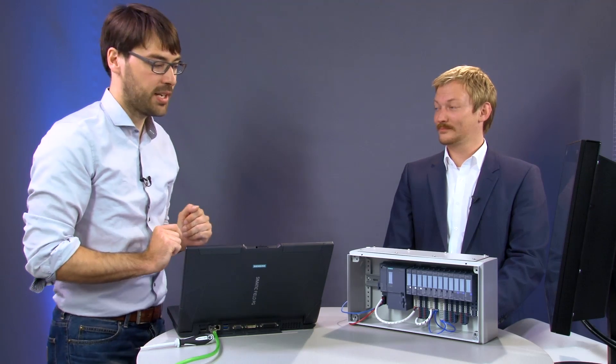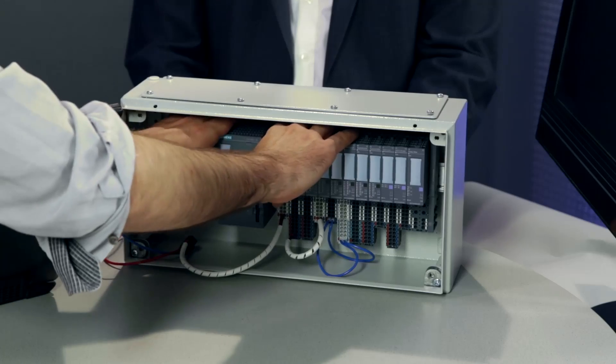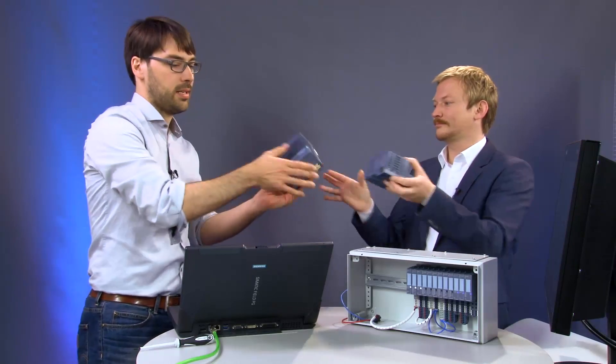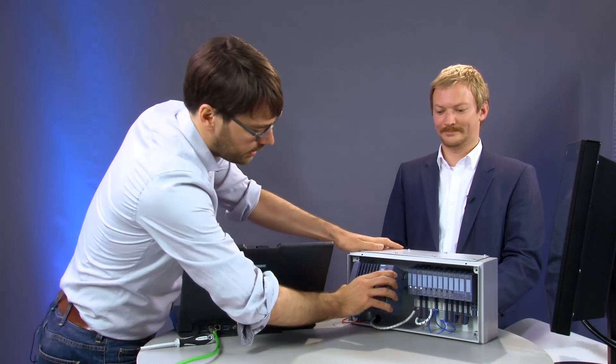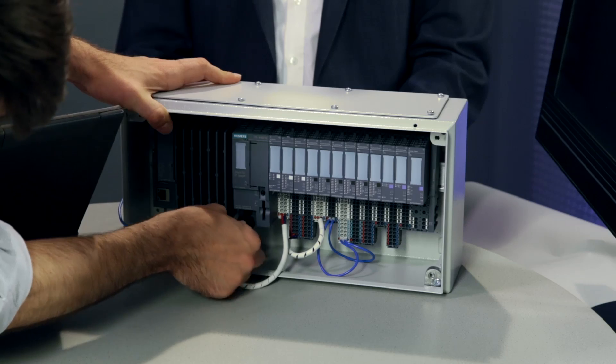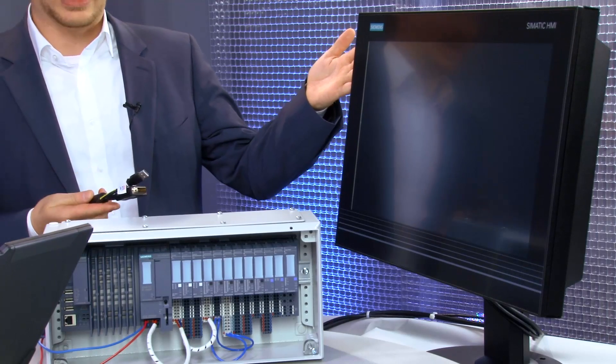To install, we will have to remove the existing CPU from the array. We disconnect the power, then detach the CPU — no tools are needed — and take it out. Next we put the OpenController in, snap it into place on the standard mounting rail at the back, and then connect the power. The OpenController is a PC-based system, which means we also have PC interfaces on board: one DVI interface and three USB interfaces. We will use these now to connect a multi-touch monitor directly to the OpenController.